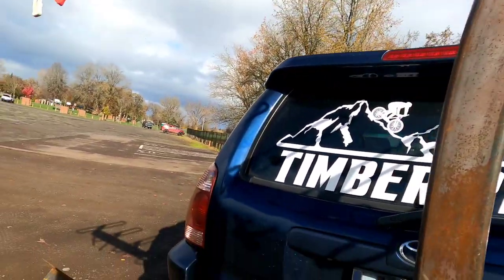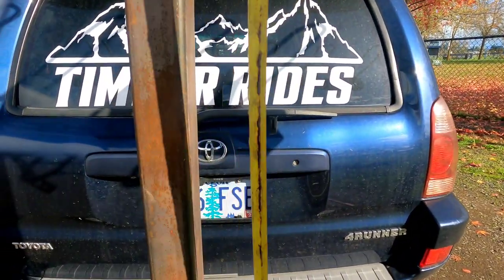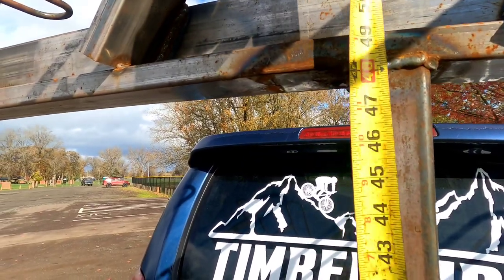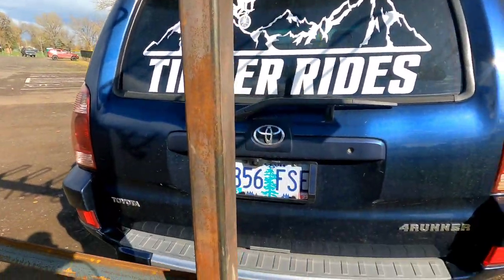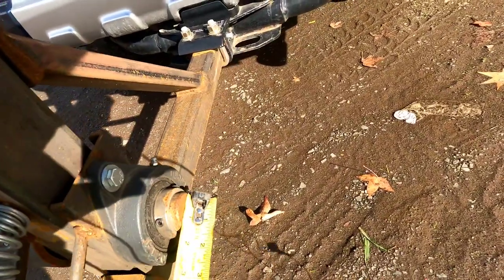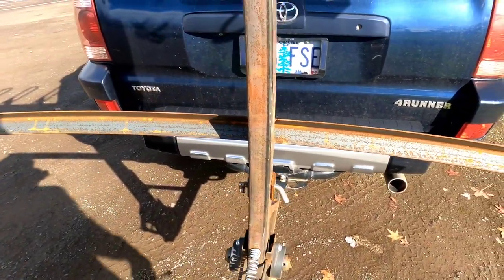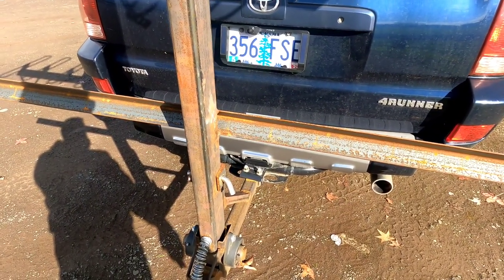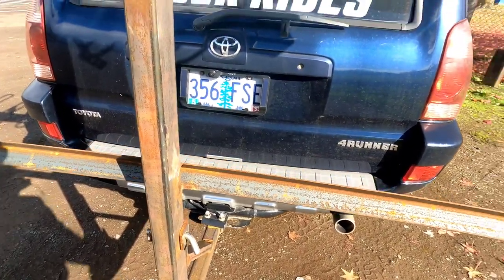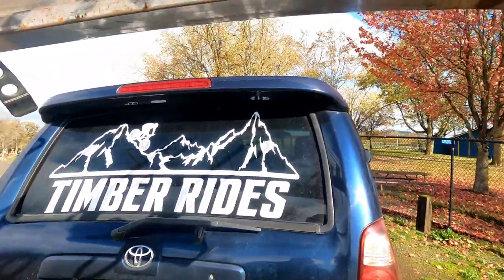The height on my old rack wasn't tall enough so I had to change that. The vertical tube is 48 inches. I used a one-and-three-eighths inch shaft with one-and-three-eighths inch two-bolt bearings. I used the two-bolt because they had a slightly smaller casing and weighed a bit less — you could probably go down to a one-inch two-bolt and be just fine. I put a piece of angle iron on there to cut back on weight.